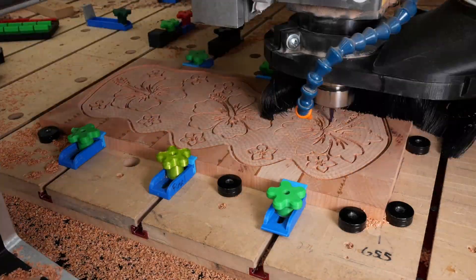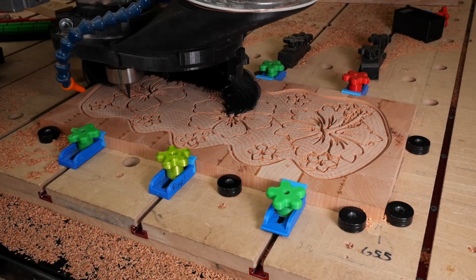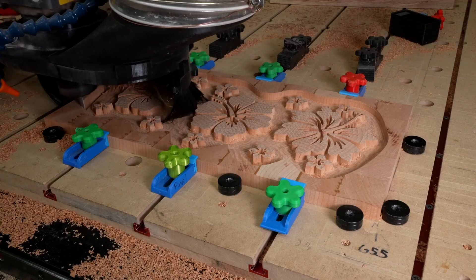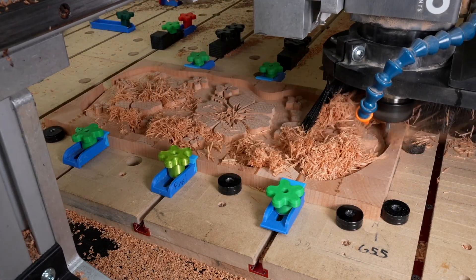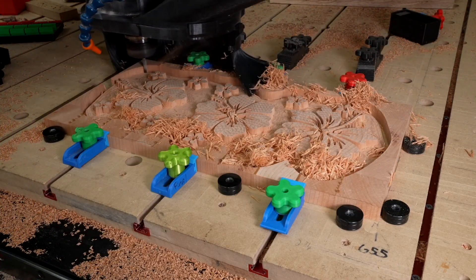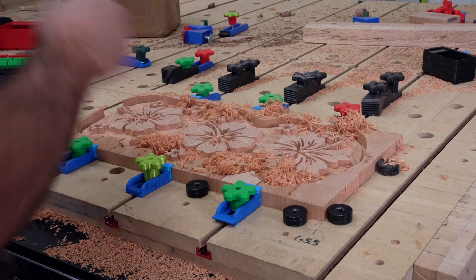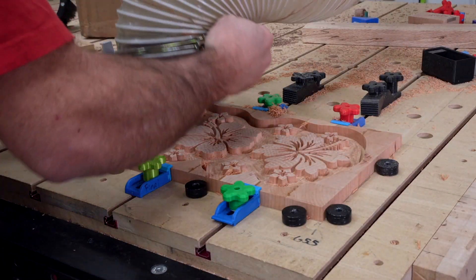I see a lot of people always referencing the top of the work piece for their Z0, which is really strange to me. I really prefer to use a spoil board, and this is a perfect reason why. My stock piece was rough, and I could machine it to a very specific size, and then go and machine out the plug. I'm not ever cutting into the spoil board, because that was my reference location, and the thickness of the stock was kind of almost irrelevant.